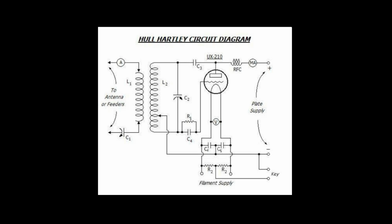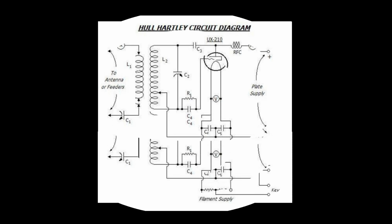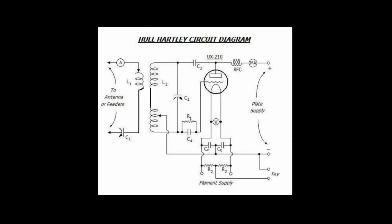This arrangement simplifies the construction of the Hartley oscillator compared to other types. This circuit is practical because it requires only a single variable capacitor to tune it, and the parts count is small. The circuit is characterized by a single continuously tapped coil, but this is actually not necessary. The coil could be split into two separated coils and it would still function, usually at lower efficiency, however.